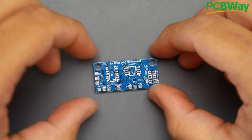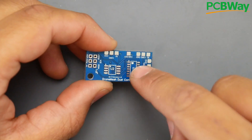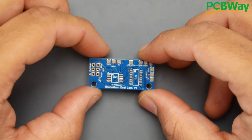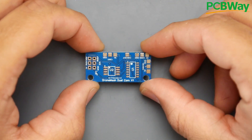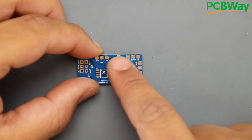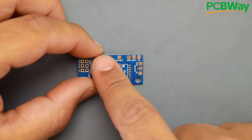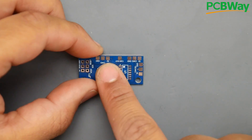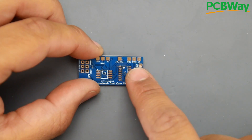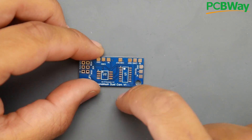Here's the board — it's very simple to set up. All you have to do is install two ICs: the ATtiny and the Texas Instruments quad-channel analog video switcher. Everything is pretty much labeled. Cam Out is the wire going to your VTX — your video transmitter — because that sends out whatever signal you chose from camera one or camera two. Camera one has five volt, ground, and the video wire (yellow wire). Camera two is the same: five volt, signal from the second camera, and ground.